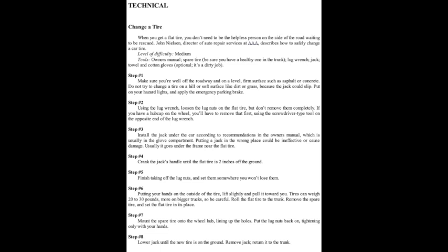Step number 6, for a two handle faucet, you'll see a nut. Remove it. See that sticking up stem? Pull the stem straight out, and with it comes the cartridge. If it's an older seat and washer gizmo, just turn the stem open to lift out the stem and washer. Look down into the hole. You may need a flashlight to see the seat. If it's shiny and smooth, it's okay. If it's not, it's the source of your troubles. Unscrew it with the seat removing tool.